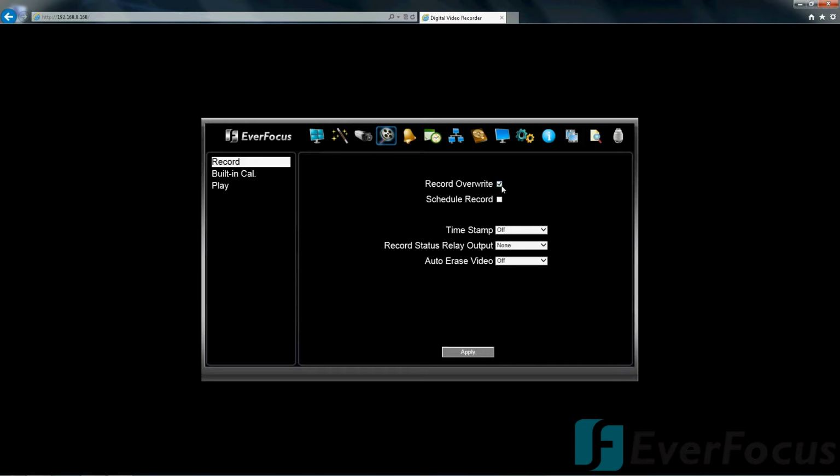Probably just want to leave it on record overwrite, so that way once the DVR gets filled, it just keeps going. Gets rid of the very oldest footage. Timestamp, you probably want that on.